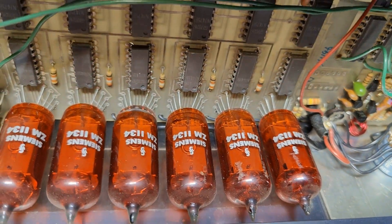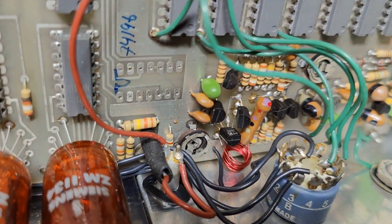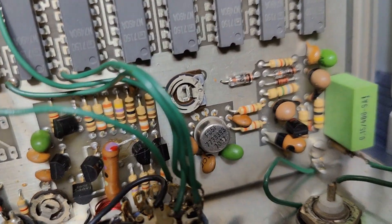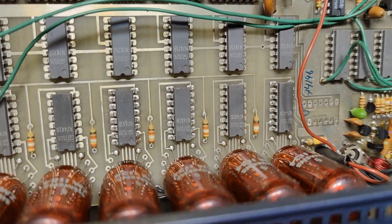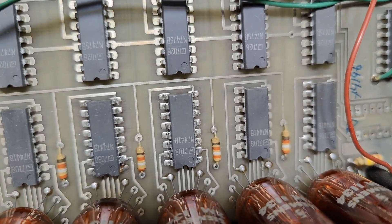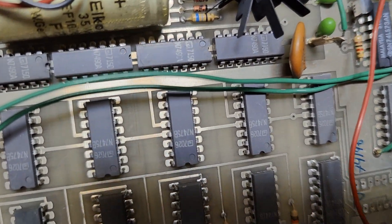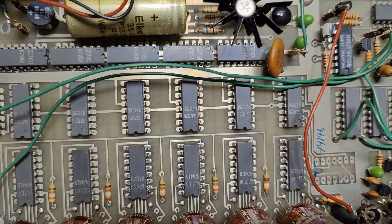The black wires go to the decimal points — that is pretty neat. It's all handled with this one switch, and that little coil and the transistors. That's most likely the signal input amplifier and something like that. The rest is the counting and driving — those 7441s. So those are old. That will be a 4-bit input driving a Nixie at high voltage. And then we've got latches for storing the counted 4-bit each.